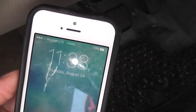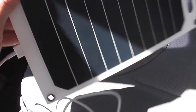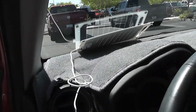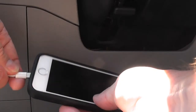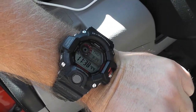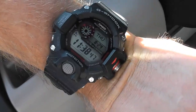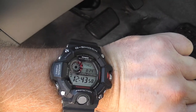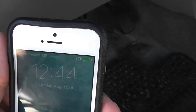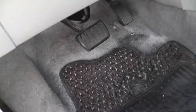I've got an iPhone 5 here. It is at 70% right now. I'm going to take the Do Cooler, throw it up here in the windshield. Not ideal through the glass like that, but let's plug it in and see what we get. All right, so we are charging. I'm going to crack the windows to vent a little bit so it doesn't get too hot. Time right now is 11:39. We'll come back in a few and see what we have. Back again — it's been just over an hour, and we've got about 87%. That would correspond with less than 500 milliamps.